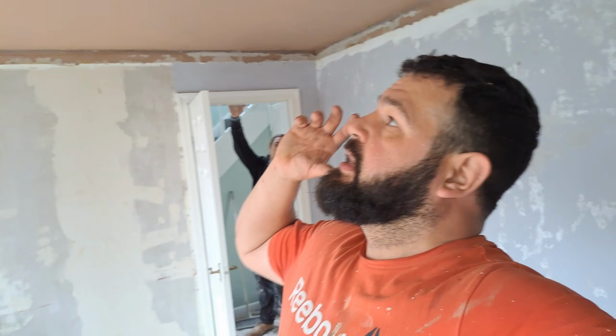Now that will, as I said before, seal the ceiling itself to a certain extent and hold back the suction, because we've let it go in a little bit. So now we'll give it a nice wet 3rd coat.